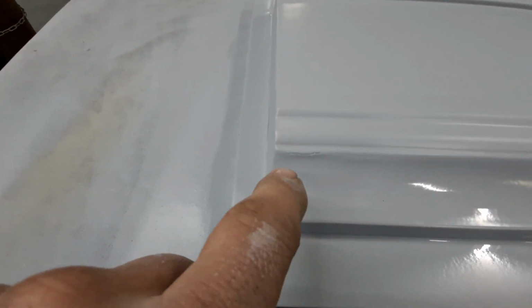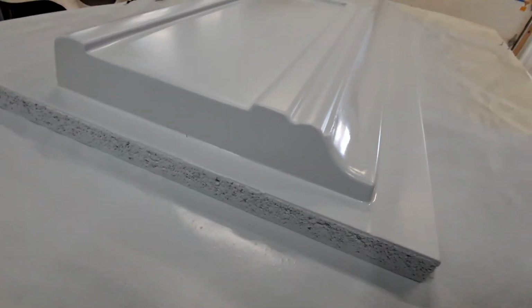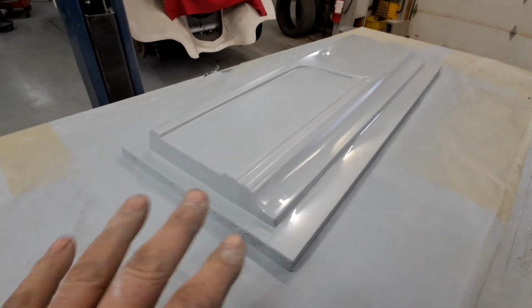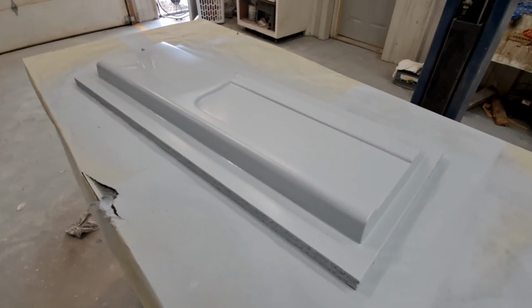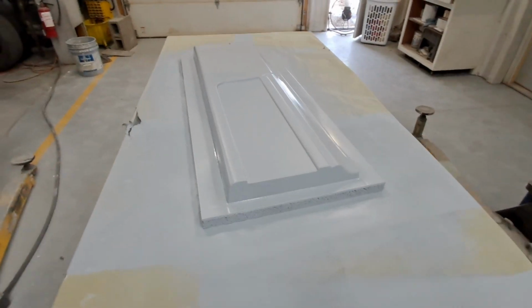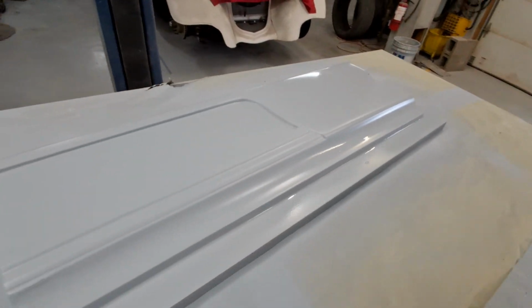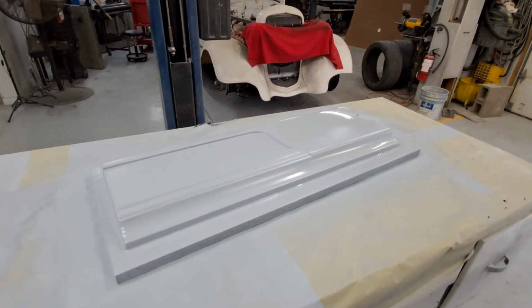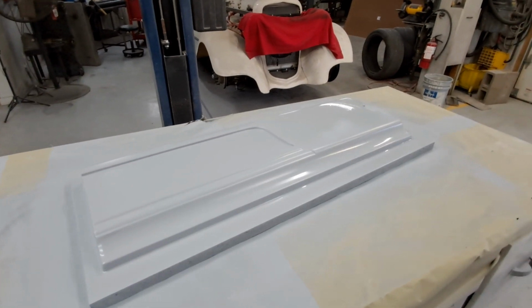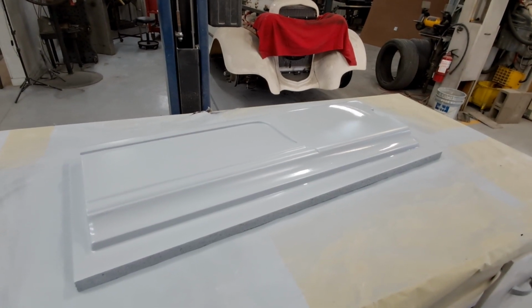And then this didn't work, but I think I'll just hit it with some glaze real quick before I sand it, because it started to build up a little bit, so it'll block out. But I just don't want to expose a large stripe of that plaster, which typically goes okay, but when you drop it on the floor, you kind of open yourself up for a can of worms. Anyway, so we'll let that cure out for a few hours and block it out, and hopefully tomorrow we can wax it and start making molds.